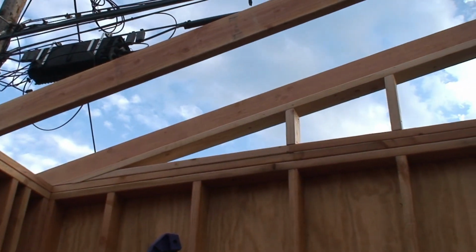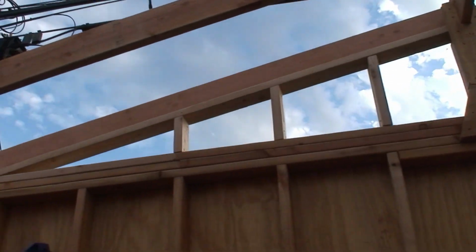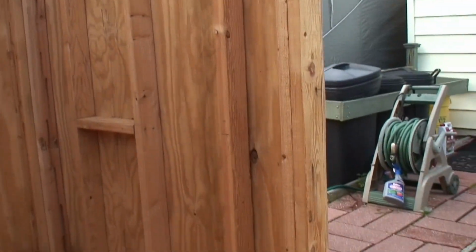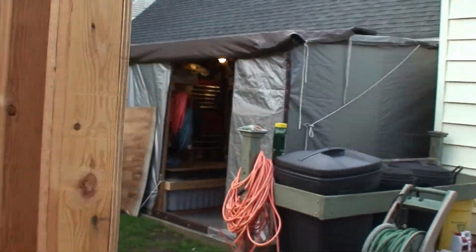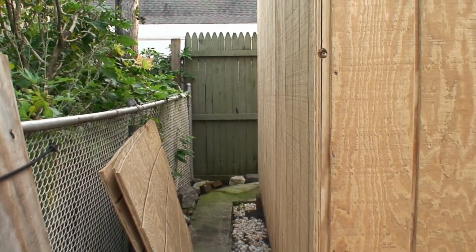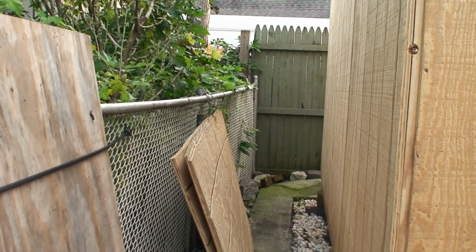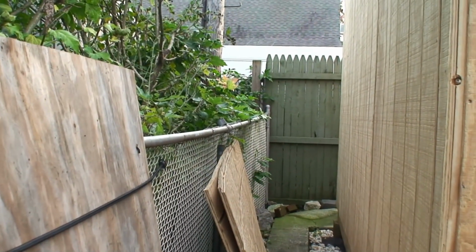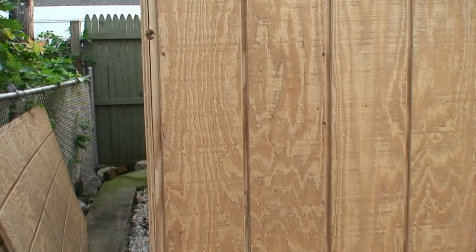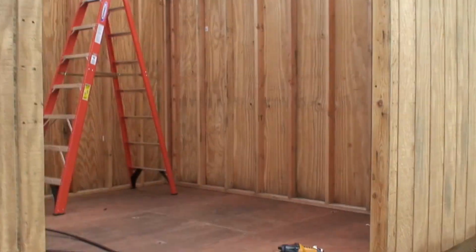All right, so I don't need any more cripple studs. I don't need a cripple stud over there. That's sufficient, because I only got a few inches when I tie everything in. So now I could, I'm losing my sunlight. The only thing I might be able to do maybe is take a look at this, although this looks like it bought the farm. I don't think I want to use that, because it was out in the open. It wasn't nailed up. When it's nailed up, it's clamped actually with the nails. Otherwise, everything here would have warped.